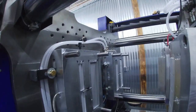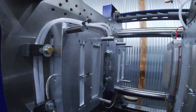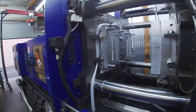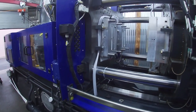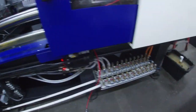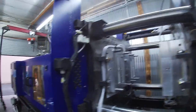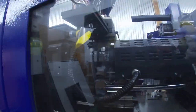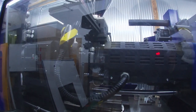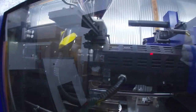And the mold over there has a much larger shot size, so it's consuming a lot more heat. What I'm finding is that the balance of energy for the two cooling systems, which I did have as separate, is not quite right. This manifold back here services cooling the mold as well as cooling the hopper chiller for the plastic coming in. It's the cooling jacket for the input plastic to the injection unit.